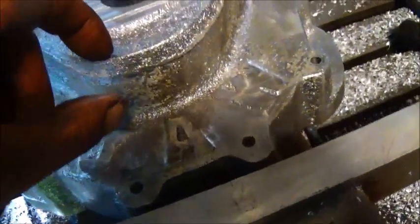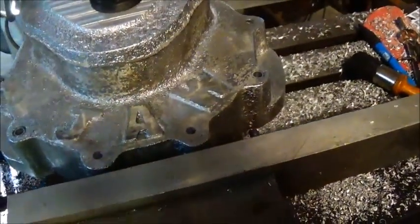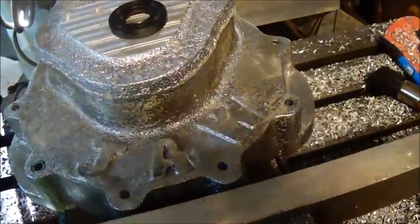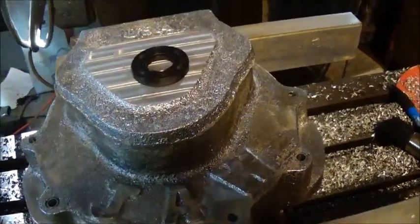I've got more of them, but what I'll do is I'll drill the hole to tap, and then I'll put a flat on it, and then we'll be able to pull it down. So we won't really countersink them, but we'll put a flat where it gets a good surface. So all right, get at it.